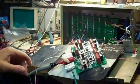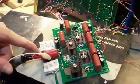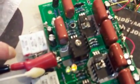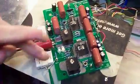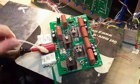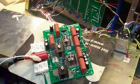Rolling. Okay. The small amount of smoke is the red insulation on this clip for the voltmeter. You can see it's melting from touching these resistors. We're drawing 900 milliamps on each side with 350 ohm resistors in parallel. They're getting quite warm, warm enough to melt this plastic, but not past the rating.